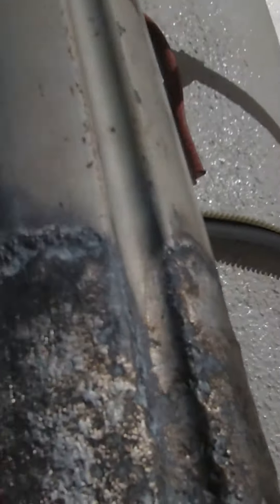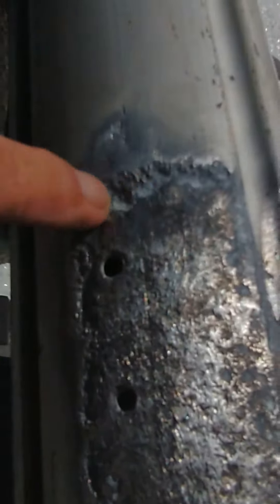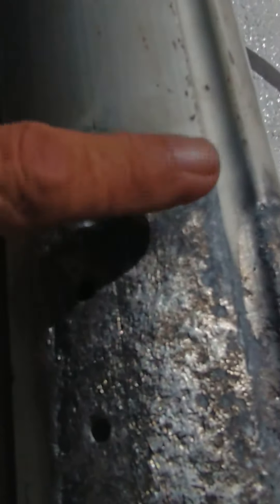So that's the whole thing we're doing here: we've got to clean this up again on the outside and make sure we get all of the oxide, the white powder, out of the grooves — or as much as we can get anyway. Then we go on the inside and spin it up with a wire wheel or wire brush with a Dremel.